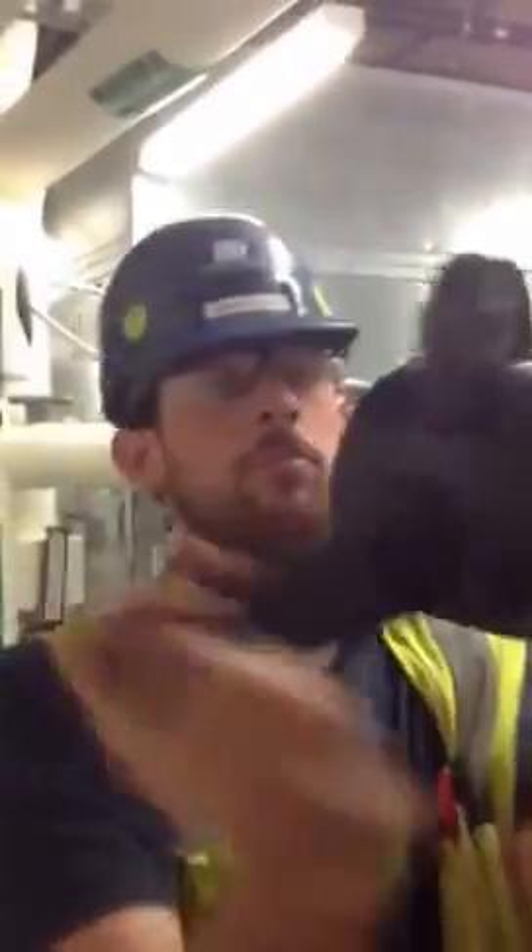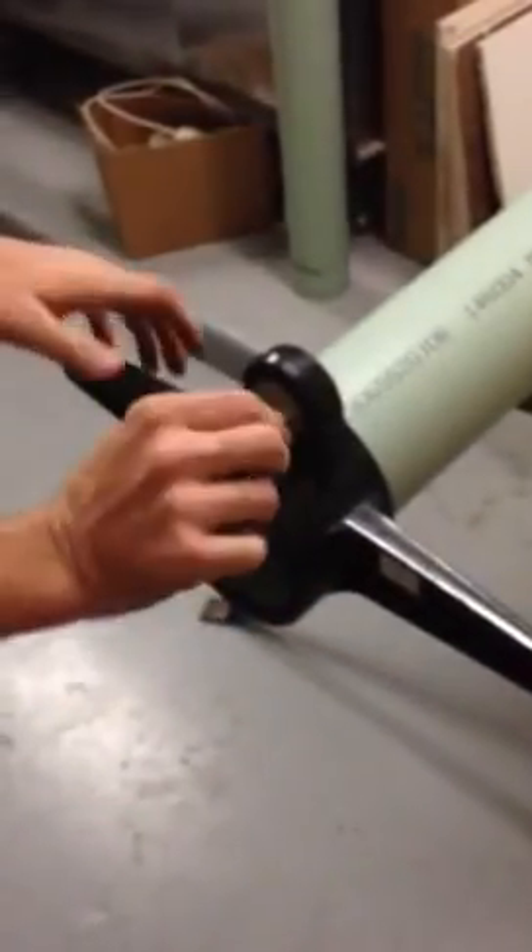There's the 4 inch groover. Now when the arrow's pointing that way, the tooth isn't down. When you flip it this way, the little tooth comes in there and comes down. Watch as I turn it back and forth — see it? Down, up. You always need to put the arrow this way when you stick it on the pipe. Make sure it's flush. Turn the arrow that way so the tooth is down.